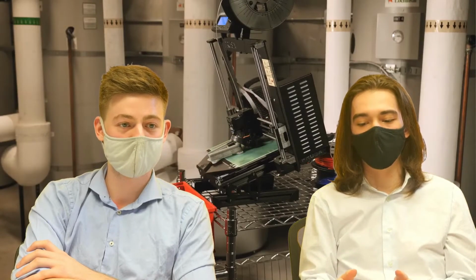Okay, chat just went by. Justin3D says more reliability with direct drive than Bowden. And if you get more reliability, that results in less downtime. That's extremely important with automation because you're running your printer so much harder. Any reliability issues are going to happen more and more frequently. So it could be worth switching to direct drive just because your printer won't be down as much.